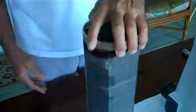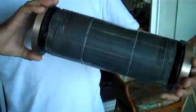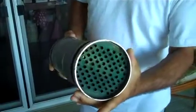The very first thing I did, of course, was to take the intercooler core and completely clean it. That just meant boiling it for an hour in something like Simple Green or some other solution. And then of course I took a rod and cleaned out all the copper tubes that go through the intercooler to free up sludge or deposits or calcification that has occurred.